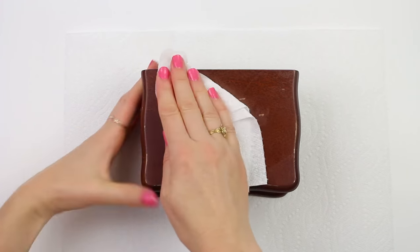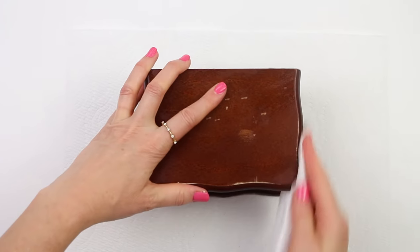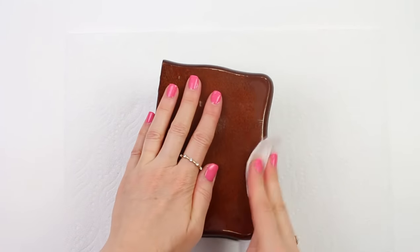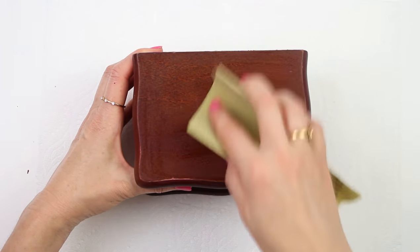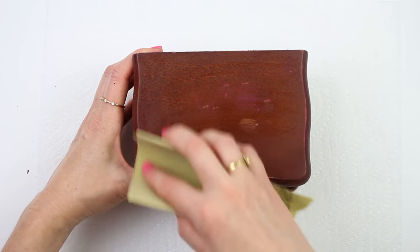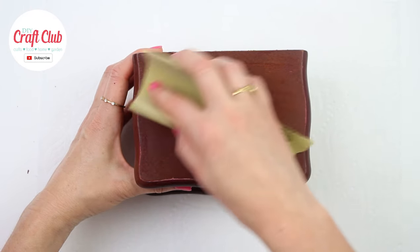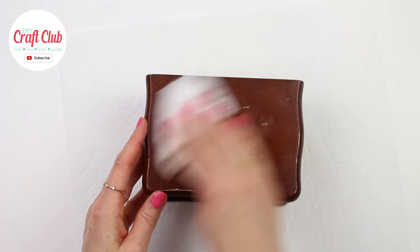Then I'm going to clean it off with just a little bit of soap and water, then switch to a higher grit of sandpaper and give the whole piece a light sanding. When you're working on pieces like this you might want to wear an N95 mask, because you just don't know what's on these things — there could be lead paint, varnish, or something else you don't want in your lungs. I'll leave a link to the mask we use in the description.